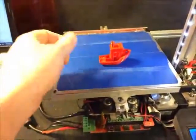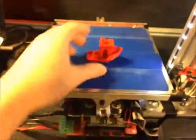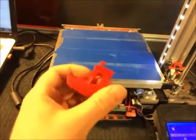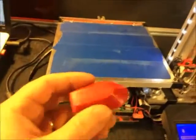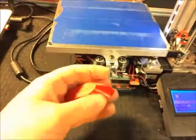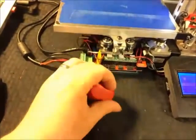All right, we are done. Let's take a look at this guy. Some stuff you have to pry off, but this should release easy. It took an hour and 12 minutes. I was running this at about 40 millimeters per second. Yeah, it came off really easy — it almost pulled up on its own. If you print a brim, it basically does a little layer around the edge and you just peel that off.